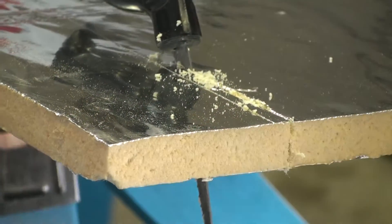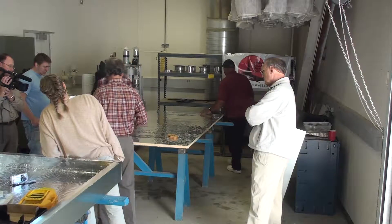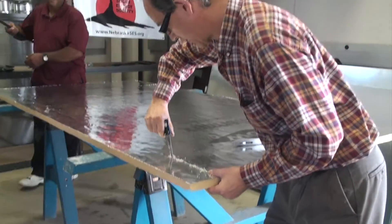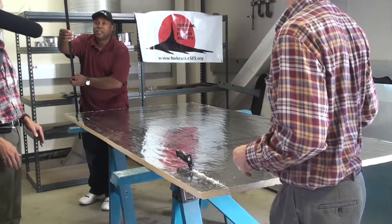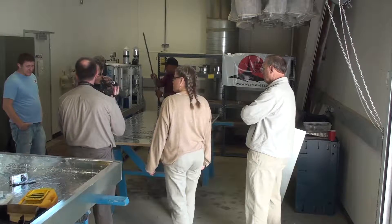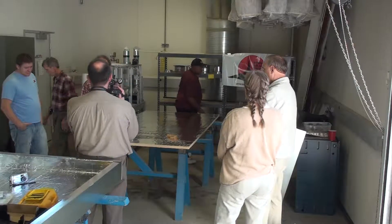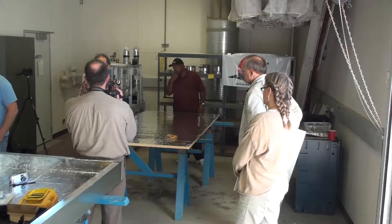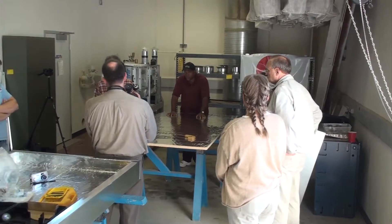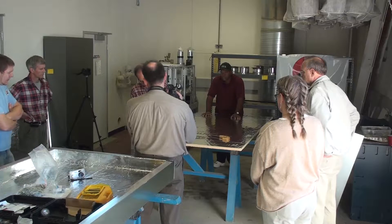The problem with using a saw blade on this is that it creates a lot of dust, and that is really not a good thing. Since we don't have a long razor blade, we're going to just use what you've got. It can be a little bit forgiving on the space — you don't have to have a snug fit. It would be nice if it's a little bit snug, but really the sheet metal is very unforgiving. It's this size, so if it's the least bit tight it won't fit in. You're going to end up with a little bit of looseness, and we compensate for that by sealing the ends with foil tape so that it doesn't have air gaps.